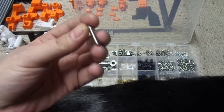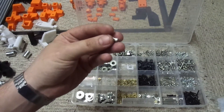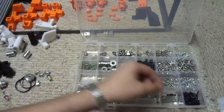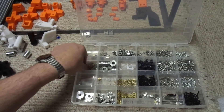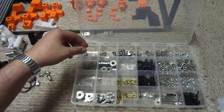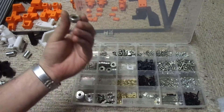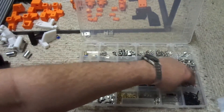I've got a whole bunch of M5 bolts - I thought I only ordered 50, but apparently I ordered 100, so I'll have enough. Those are 20mm length. These are 16mm M4 bolts. These are 20mm M3 bolts. These are 40mm, 16mm, and 10mm M3 bolts. I got some springs for the bed - I don't know if I'm going to use M3 or M4 yet for the bed leveling with the big plate, because it's a pretty sturdy plate. These springs are really stiff. I got some 608ZZ bearings - the common skate bearings - and those are going to be for the lead screw. And of course I got M5 nuts, M4 nuts, and a whole bunch of M3 nuts.